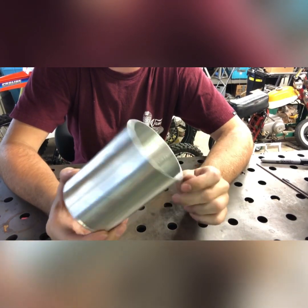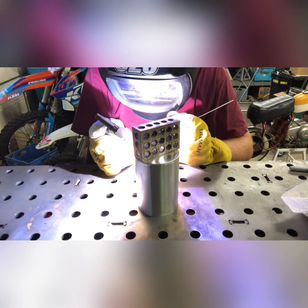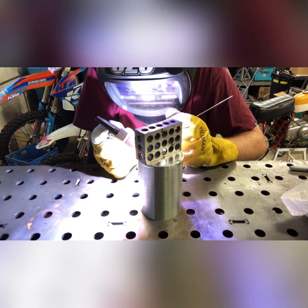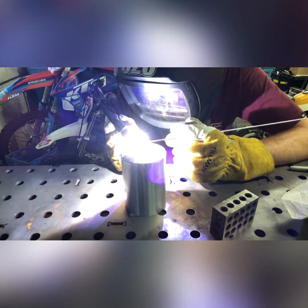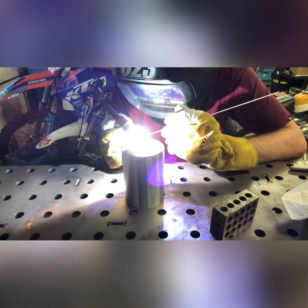Now I'll mention there are a few things you should be aware of. I'm going to take this opportunity while I'm welding to explain some important factors you should take into consideration before you try anodizing for yourself. First, the warnings: the chemicals used in this video are hazardous. Please ensure you have proper ventilation — you don't want to breathe this stuff in — and keep some baking soda close by to neutralize the acid in case you spill it. Wear gloves and eye protection at all times. And most importantly, don't be an idiot. Ask questions if you don't understand something — I'll be glad to answer them.